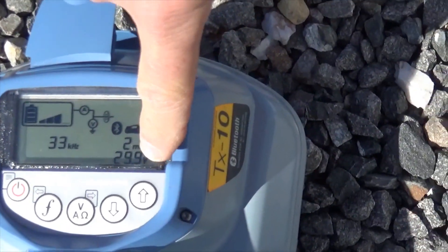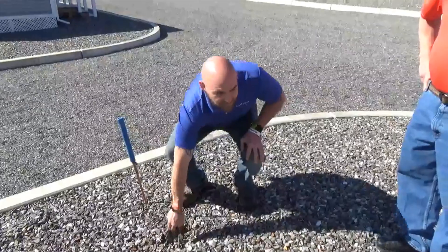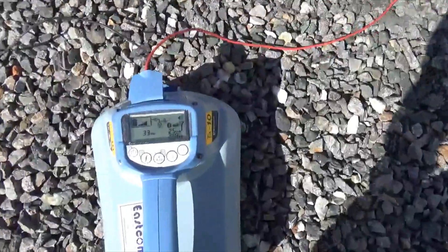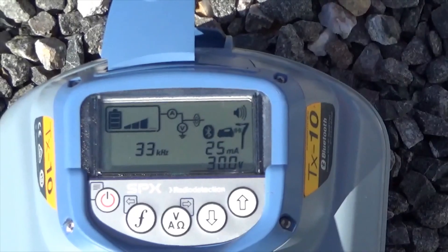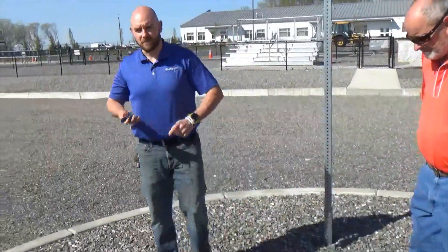So we want to try and get a better ground. Rather than just using the ground spike, we can use a signpost that's also in the area, connecting to it via a magnet. Now we're getting 25 milliamps and a much deeper tone — you can see it's giving us a much stronger signal. The signpost has more connection to earth than the ground spike.